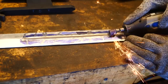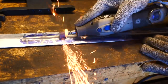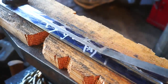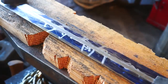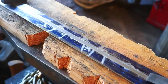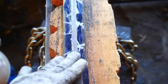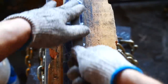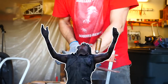The Dremel is good at removing marks in this groove from the file, but it creates fairly wavy lines and tends to jump the lip of the fuller, leaving marks over the bevel. So it's good for touch-up but not for stock removal. It's back to the file — and five hours later, one side is almost done.